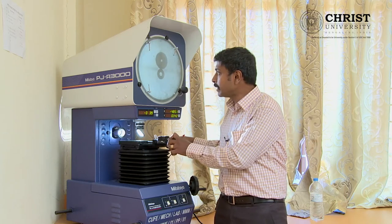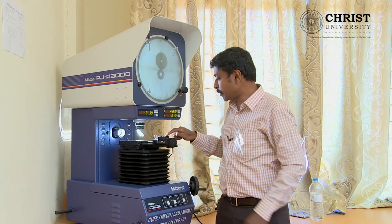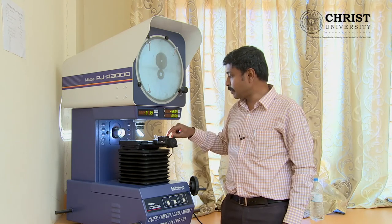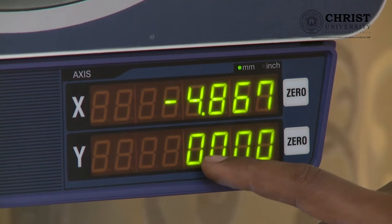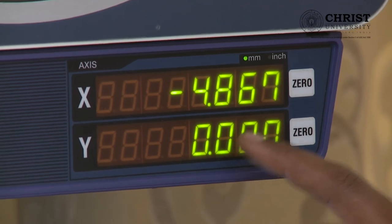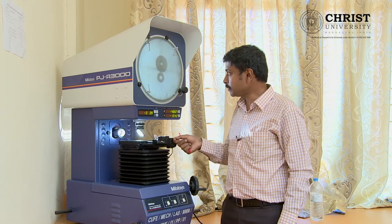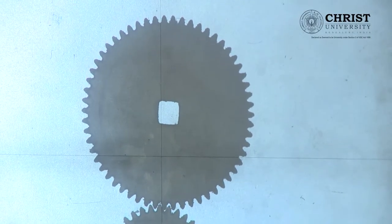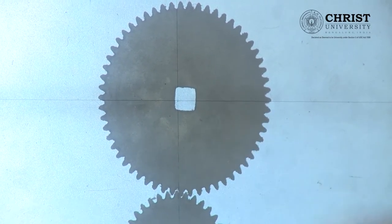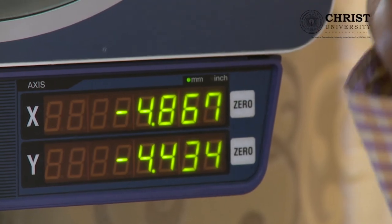Aligning your tooth on the point — we call that the pressure point — make this point as 0. Press the 0 button (the larger one). The 0 is now reflected on the y-axis table. Revolve your axis slowly towards your center. I am revolving and reaching a specific line which seems to be the center. The value I am getting is 4.867 — a different value from the previous iteration.